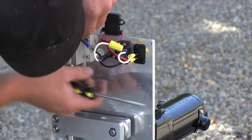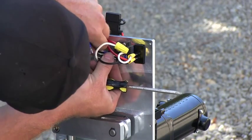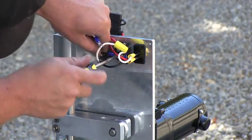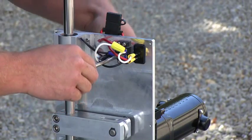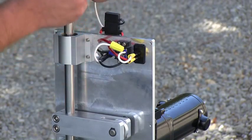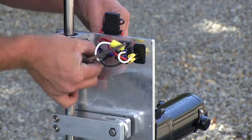This is a five-gallon per minute pump cylinder at the bottom, but that five-gallon per minute is over a 10-inch stroke. This is a five-inch stroke, so what you're going to see here when it starts up is about two and a half gallons a minute.